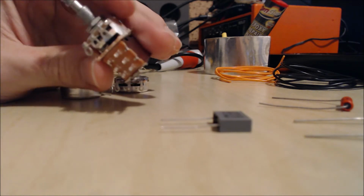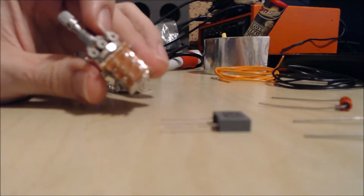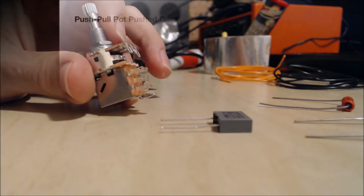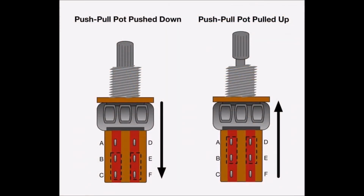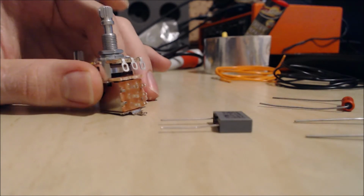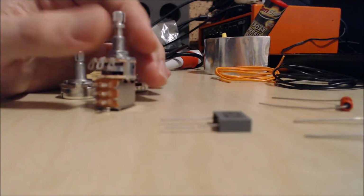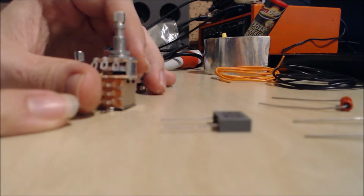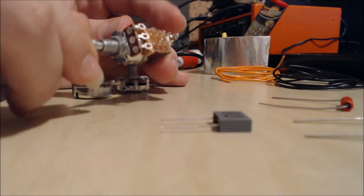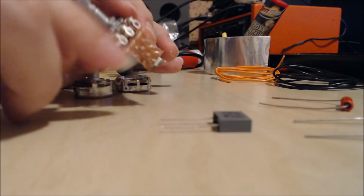I forgot the exact way that these little tags here interact, but I'll put an annotation on the screen of what kind of switch this is, and I'll have a link in the description to a good website that explains these pretty well, so they're pretty easy to figure out. But the actual potentiometer and the switch are not electrically connected, so the potentiometer works either way, whether the switch is in the up or down position, and it works separately to the switch.